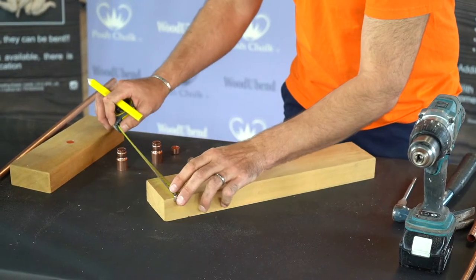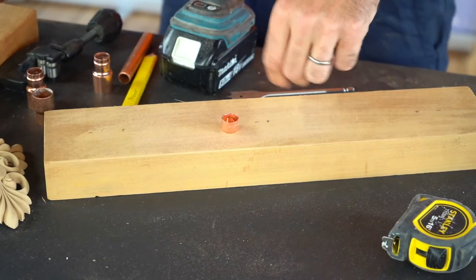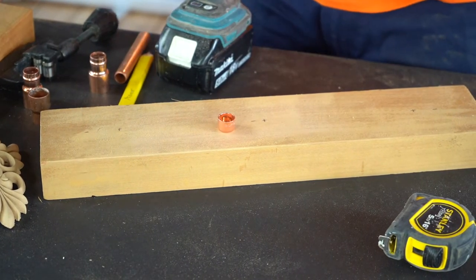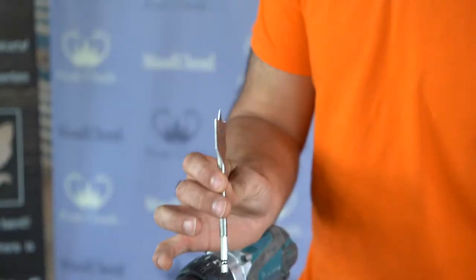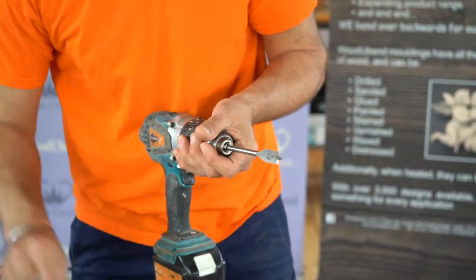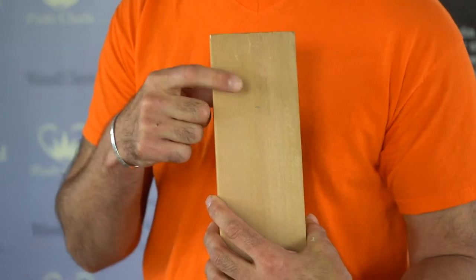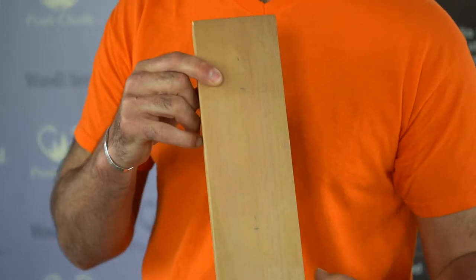The base is nine centimeters wide, so four and a half centimeters to center up. We need to bed these stop ends inside the wood — they're going to sit inside the stop ends. To do that, you use a spade bit; it's got a number on it that says 16, so that's 16mm. We've made our crosses, divided it into three.